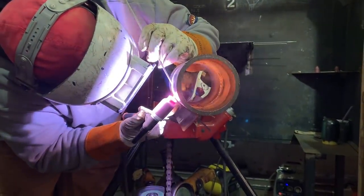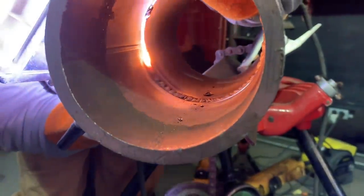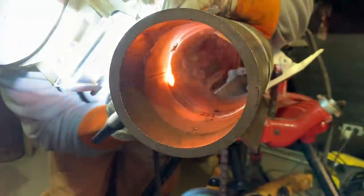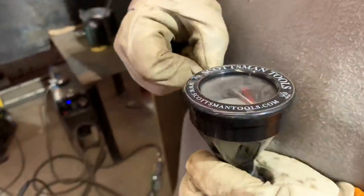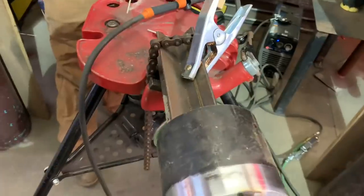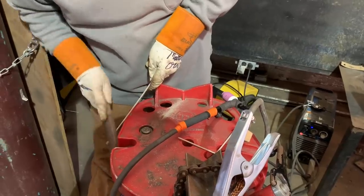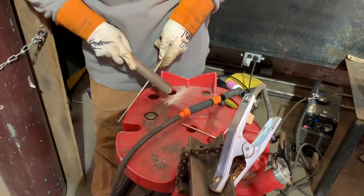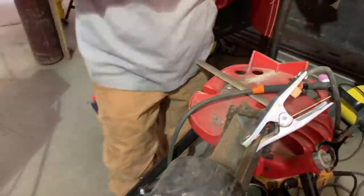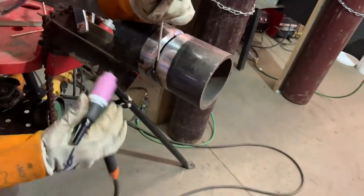We're going to speed things up a little and show you the other technique — not the back feeding but the keyhole dip — once we get to the top side. Most of the in-service welds you're going to have to make are in 5G. Here he is keeping that tungsten sharp — great for field welds if you can get that Scotsman Tools tungsten sharpener, it's battery powered, throw it in your bucket and take it up in the pipe rack with you. Here he is scraping the flux off one side of that flux coated wire, which gives him a little better visibility of the puddle so he's not having to look through the flux.